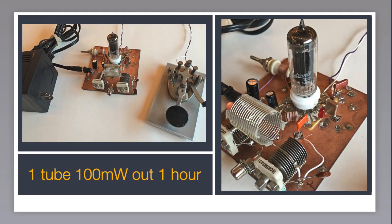The photo on the left shows a compactron pad using a chassis mount socket, and a 9-pin pad on the right. Prototyping thermotrons in this way is fast — no more punching holes to hold sockets in an aluminum chassis and mounting terminal strips and standoffs. This is the fastest transmitter I ever built: one tube, 100 milliwatts output in one hour. It uses a low voltage space charge thermotron — needs only 12 volts on the plate furnished by a 12-volt wall wart power supply. A good example of a low voltage thermotron project. It took me longer to make a contact than it did to build it.